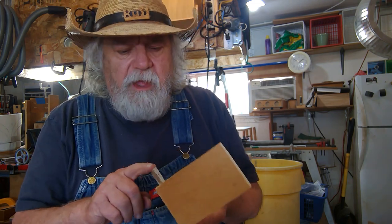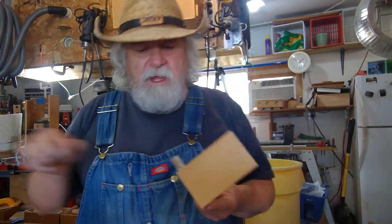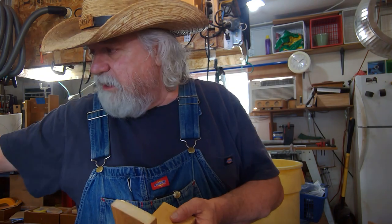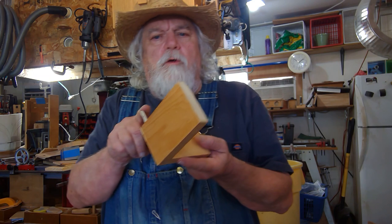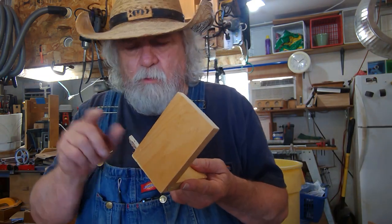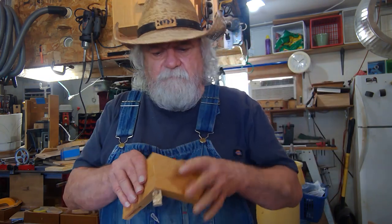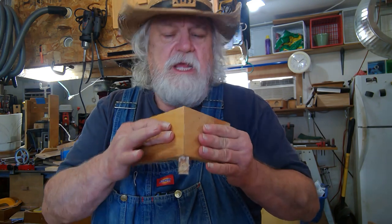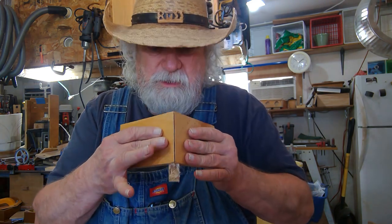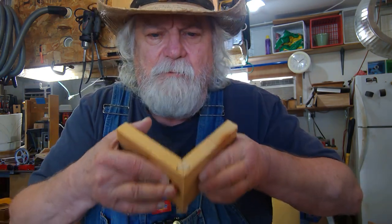The first thing I did is make sure that the thickness of the piece I was going to use is the same thickness as my dado stack that I always keep in my table saw — it's a quarter inch. So I have quarter inch material just laying around that I can use anytime I want to make this kind of joint. It's a good strong joint with lots of glue surface, and this thing just will not come apart once you glue it together.